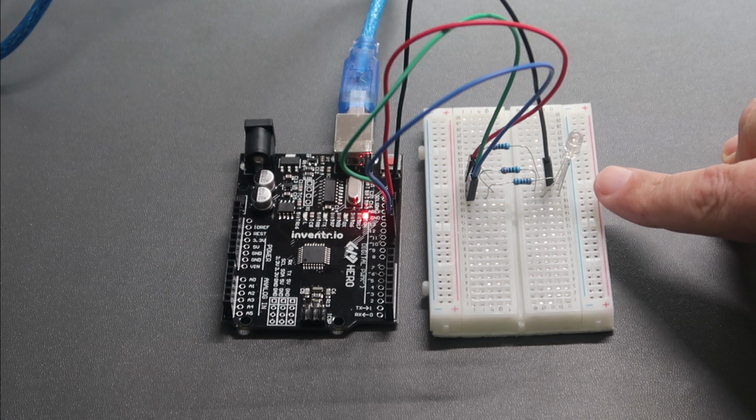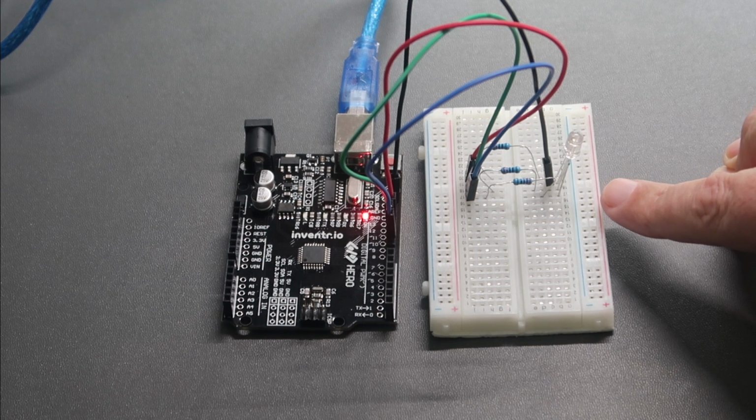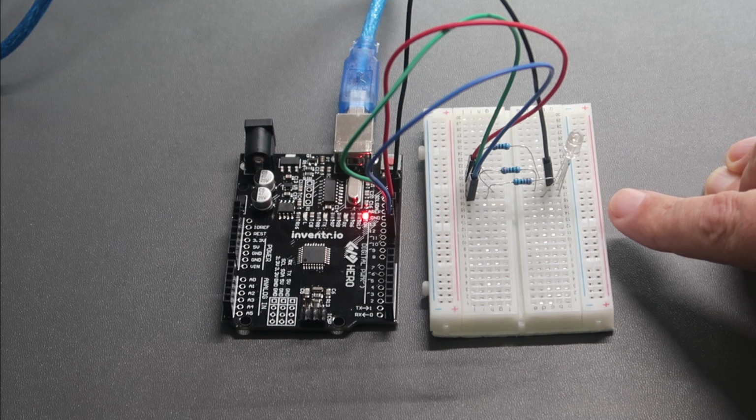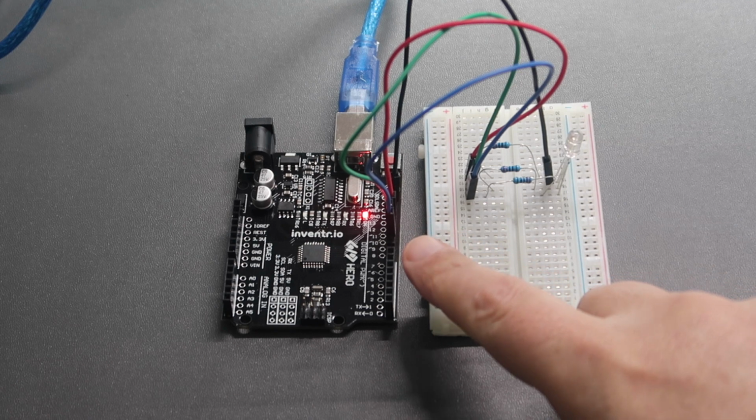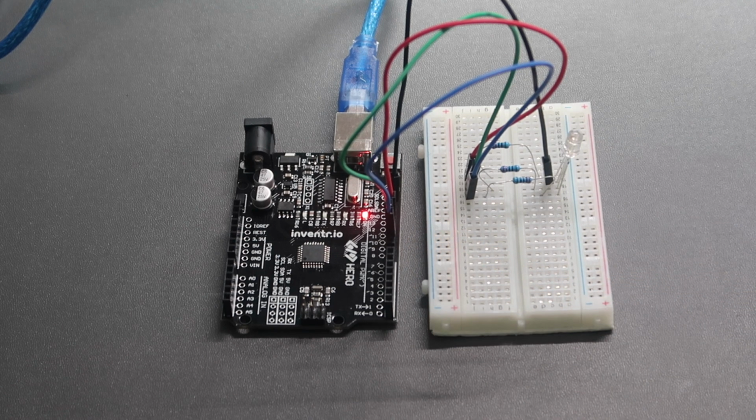It's a 4-pin LED. Pin 2 goes to ground, and the others control the red, green, and blue signal. Depending upon the intensity you send to these pins, the LED will use that much of the RGB color. The RGB pins from the LED are connected to special pins 9, 10, and 11 on the hero board. You can watch the kit's video for day 8 to learn why these pins are special, and it's an integral part of the Arduino/hero board.